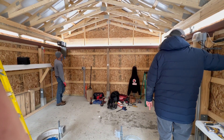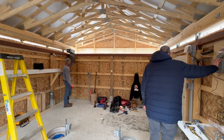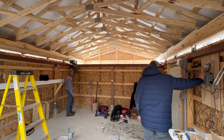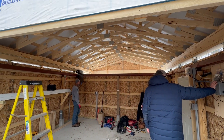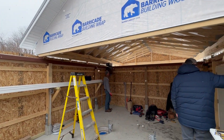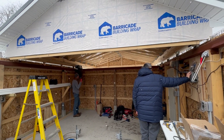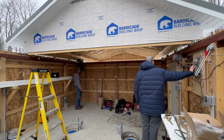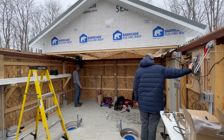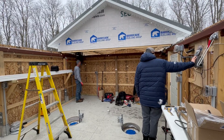At this point we were able to do our first real test of the motor system. I pushed the button expecting the roof to open completely on its own, but it's set up so you have to hold the button down — that ensures the roof continues to travel until the magnetic sensors engage and tell the motor to stop. The roof stops within about one gear of the motor, so there isn't much inertial roll after disengagement. Everything worked wonderfully, though on this first opening we were getting snow in the observatory — we'd picked the day expecting no snow, but of course that was not the case.